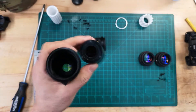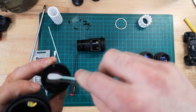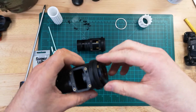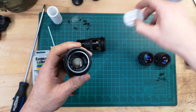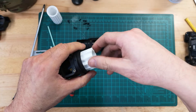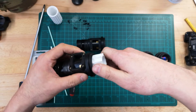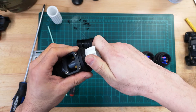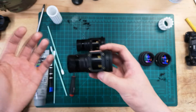Line up the alignment notch and close the lid first before installing the second tube. Make sure you don't over-torque the retaining ring, but it also has to be tight enough that the tube isn't flopping around.